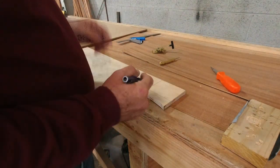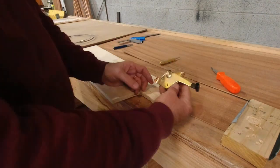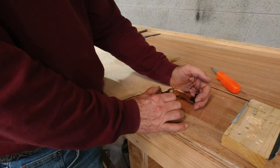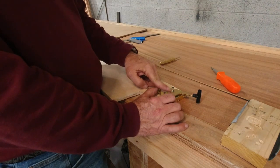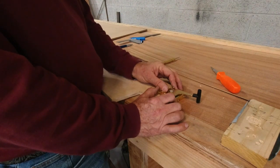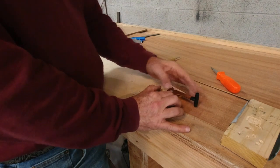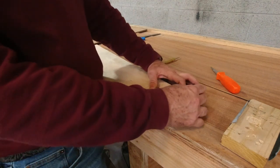Just like a rectangle. And the way this works is, if you can imagine it, when I pull up on this, because I want to trim the plane up, it's going to pull on the tab on the elevator, and the tab is going to go down, which is going to make the elevator go up. You have to really think through that and understand how that works. But when the trim tab goes down, it's going to make the elevator lift.